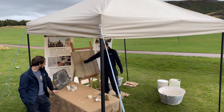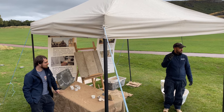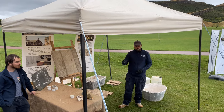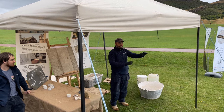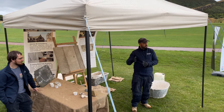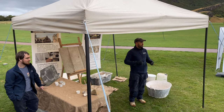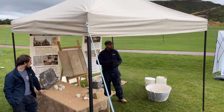Harling generally comes in a three-coat system. Your first coat is a pricking-up coat — just a thin dash with a wet mix, single grain thickness, only 3 to 4mm on your first coat. That gives you a good key to hold the rest of the coats, and it also gives you a unifying coat. Instead of having brick, stone, slate, and mortar, it's all now one material, meaning the drying rate and background suction rate are all exactly the same throughout. Then you have your straightening coat — depending on the wall, you may or may not need it.